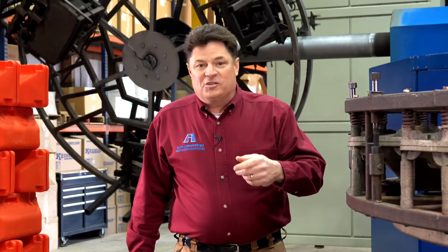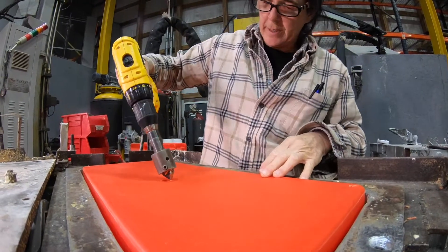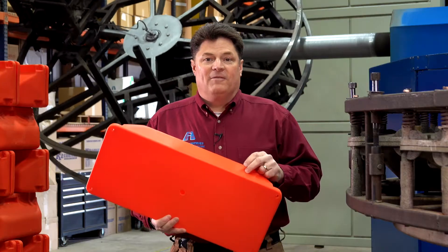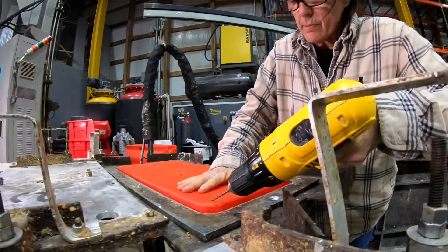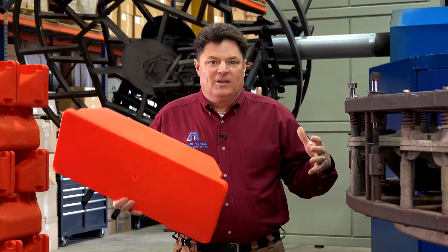How do you foam a rotational molded part? Well, at Ash Industries it is very similar to that can of foam that you may buy at the local hardware store — the one you spray into the wall that fills up an outlet to keep the cold weather out in the winter. Don't forget that this is a hollow part. All we need is an access point. We have a small hole in which we get the foaming components into the mold, and once there they continue to react until they expand and fill the space.